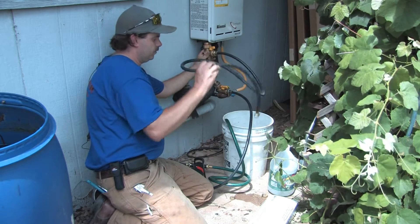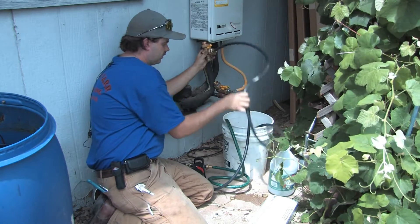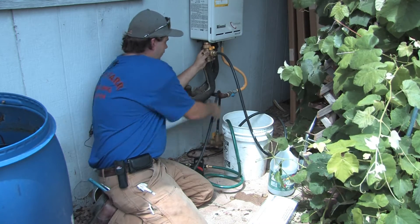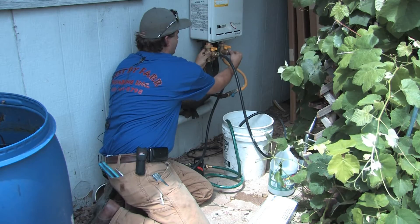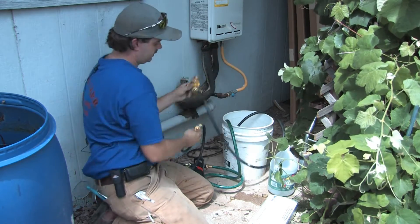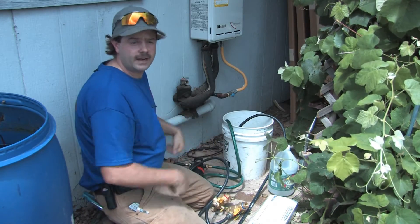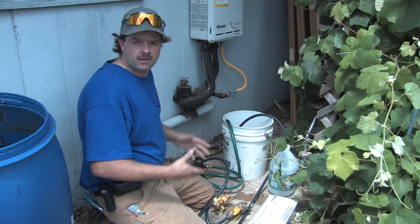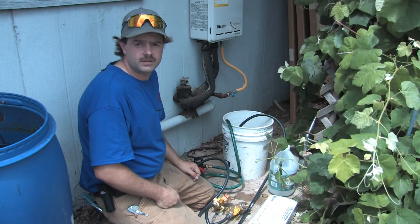Now you're ready to begin pumping. What you do is stick this outlet back into your bucket, so you have two hoses coming out of your bucket: one of them is going into your pump and out to your cold water side, and one of them is coming out of your hot water side going back into the bucket. Then you simply plug the pump in and let it do its thing, because what it does naturally is pump the vinegar through and clean it out — one of the most natural forms you can use, and it's really non-harmful to your system.